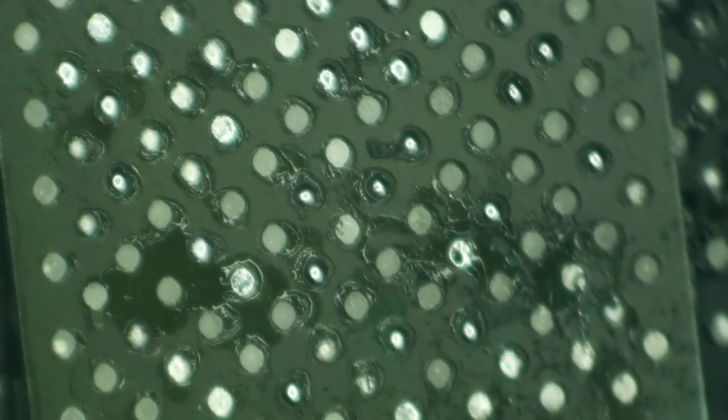All right, let's pull the NAND off of here. I'm turning my air up to 340 degrees C with an airflow of 40. All right, blade's going in. NAND is coming up. Not the most pretty NAND removal ever, but we'll take it.